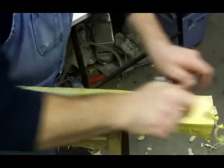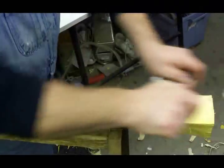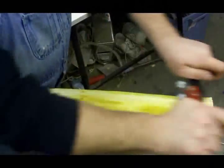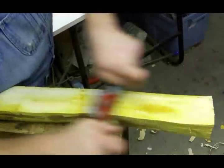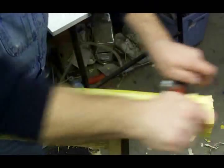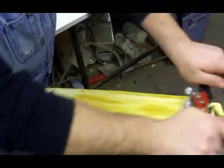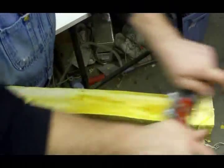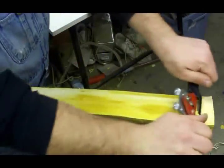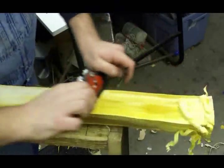Just keep pushing — try to hit the high spots. Work on the edge of your stave, come back towards the top or the crown, work your way around to the other edge, get in a few licks, come back over the top. Do that until all my white wood is gone and I can see yellow through there. A whole lot easier than trying to do all of this with the draw knife. Sometimes you have to pick your little curlies off of there, but most times they will fall off and the next one will push them out.